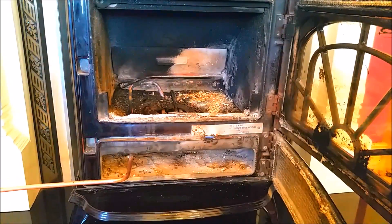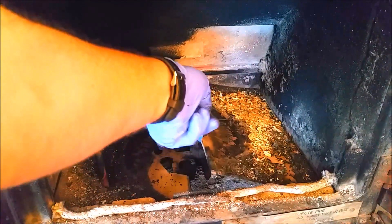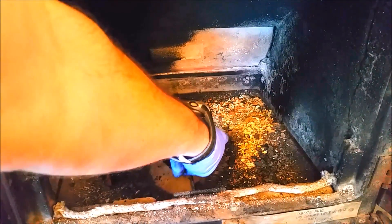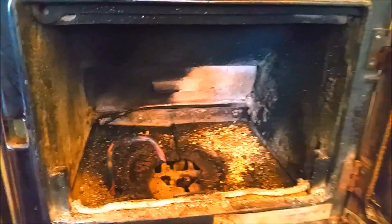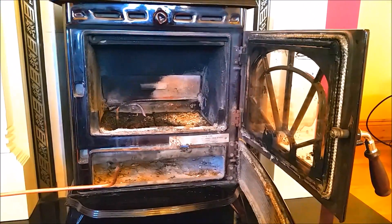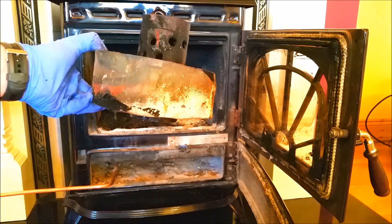Inside, further inside in the stove, I put in a couple of plates. These plates are just metal I had in there, and their sole function is just to force all the air for combustion up through here. The reason for that is the type of burner I made absolutely has to have all its air coming up from the bottom - it draws the air from outside of the stove. I've showed this burner a few times. This is my own design. It works really, really well. Very easy to make and cheap as chips.